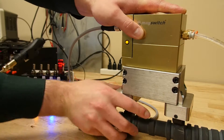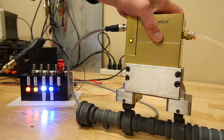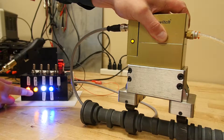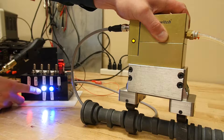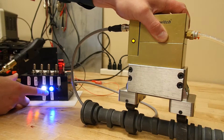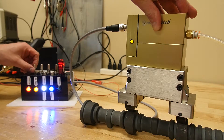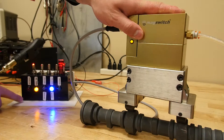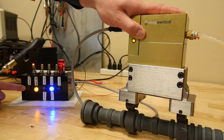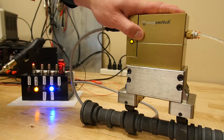I can adjust this further — I moved the unit a little bit and the unit is still on. The red LED indicates part presence, the orange LED indicates tool on, the white LED indicates that the north pole is on target, and the blue LED indicates that the south pole is on target. If I switch to a more sensitive setting, the north pole goes off target again — the red part-present LED and the white north-pole LED both go off, indicating that pole is off target.